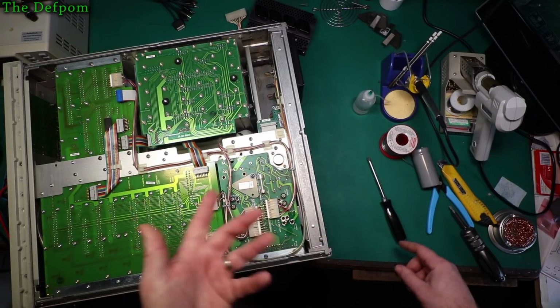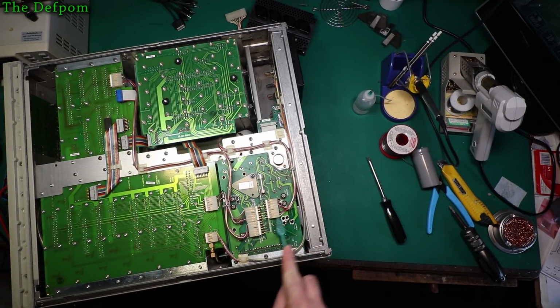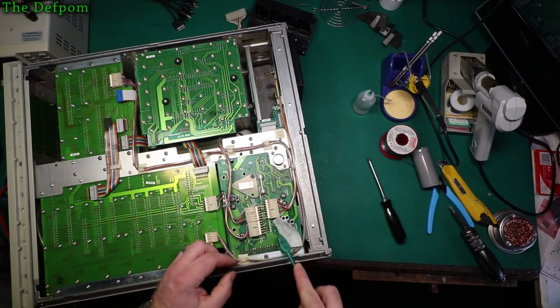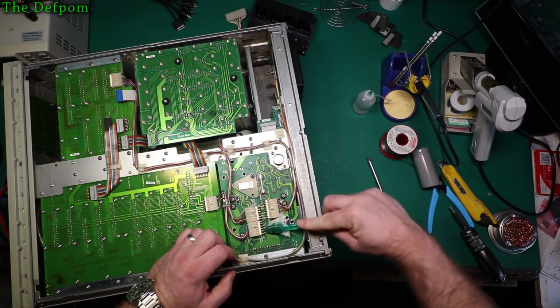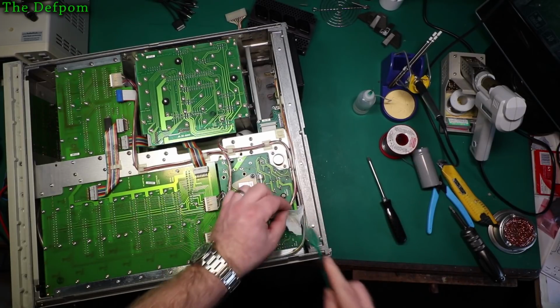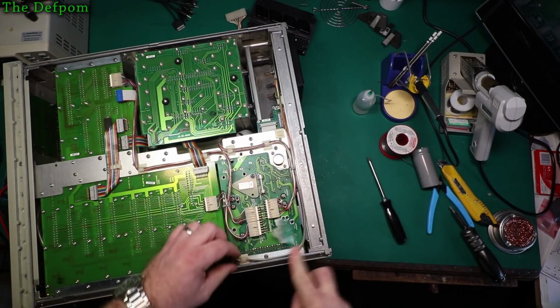You don't need it for cleaning flux, but if you're cleaning front panels and stuff like that, a little bit of water helps to get any dirt off. So that's why I do that. It's quite a common technique. Just use a slightly diluted IPA. Such a small amount that it doesn't actually matter, because it will evaporate off pretty quickly anyway. So no real problems there.